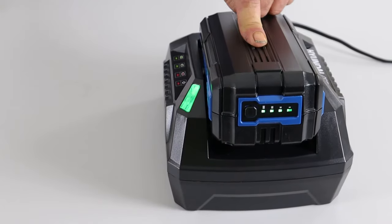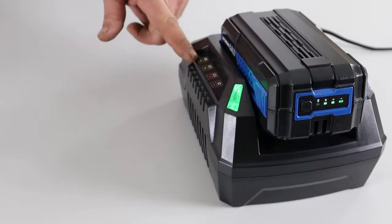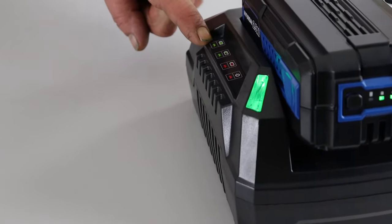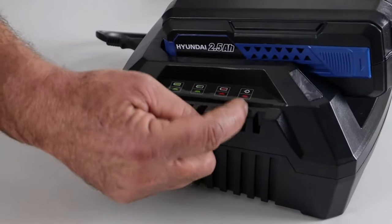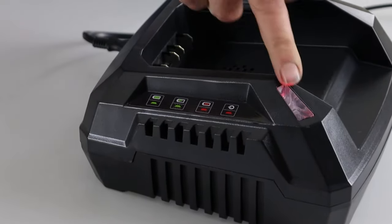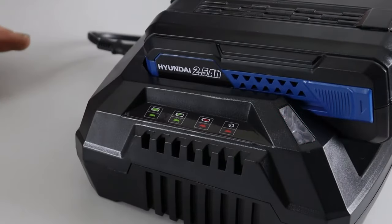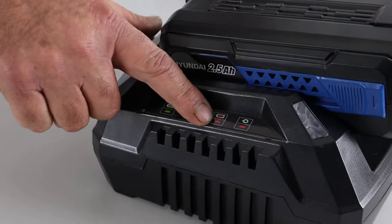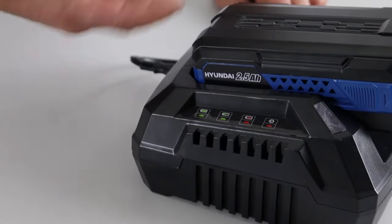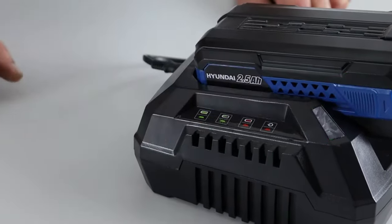With the battery charger plugged in and the battery in place, we can see the green light is flashing. A flashing green light means it's partially charged but it is charging. A continuous green light means it's fully charged. There are two other symbols: a continuous red light means power is on but there's no battery in it. A flashing red light, which you'd see having just discharged the battery, means the battery is still too hot — it needs to cool down before it will allow a charge. It's an overheat warning. Typically you can leave it in; it'll wait for the battery to cool down, and then the green light will start flashing once it's cool enough.